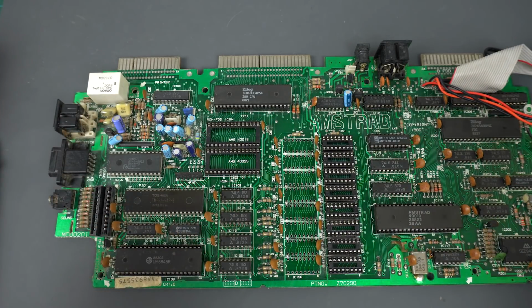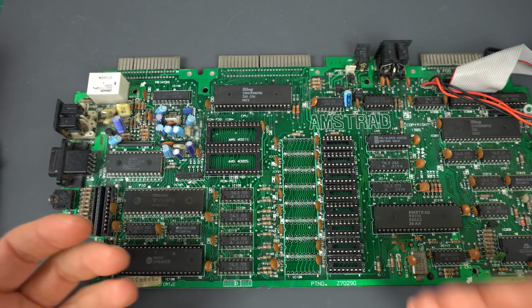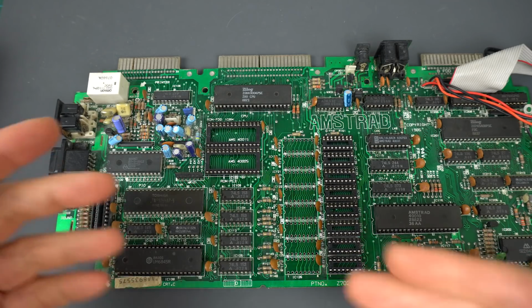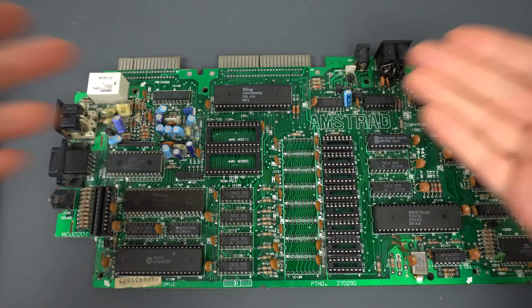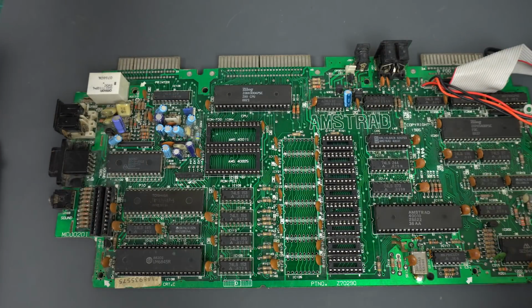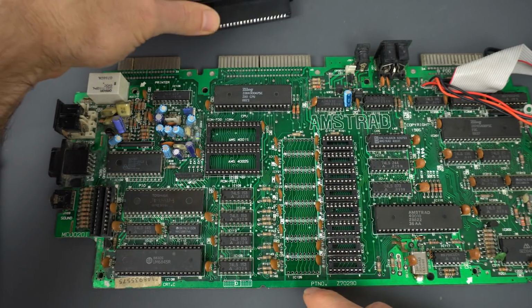So I looked at it with the oscilloscope, a bunch of things, and looked at the buses, and I managed to convince myself that the Z80 is working correctly, or actually, well, I knew it was working correctly because I tried it on a different computer, but that it is actually reading the data correctly from the Dead Test ROM that we have stored in there.